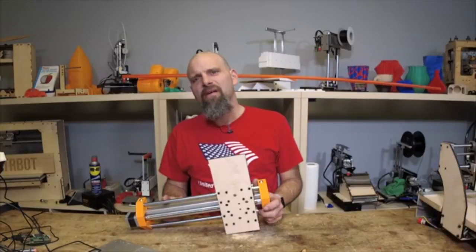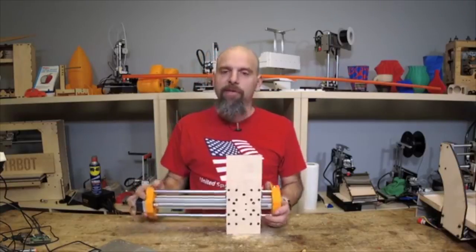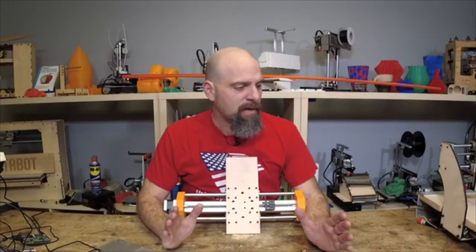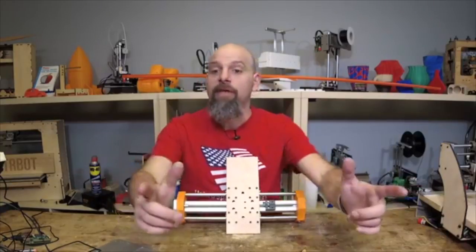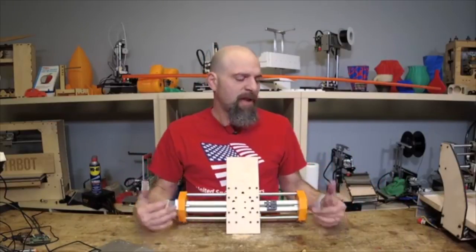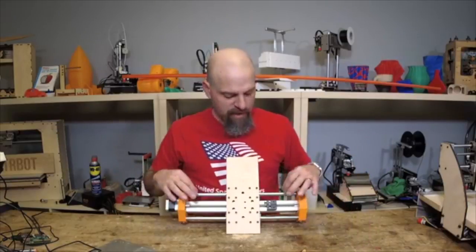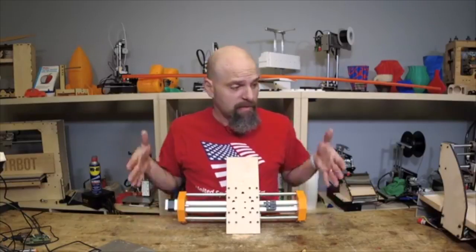15-inch bars are what we use for the Super Z. Oh, so these are it. Yeah, we don't have longer ones, but you could start with this, and if you like the design, really all you'd have to do is have a longer section of extrusion for your 18 by 24, which was the biggest. You could have 24 inches of, it'd have to be slightly longer extrusion. So you could have a 3 foot section of extrusion on the sides, and you could source some longer bars and replace this extrusion, good to go, because the side pieces will work fine.